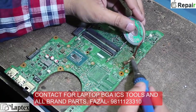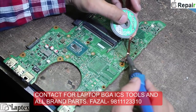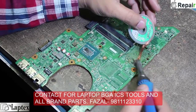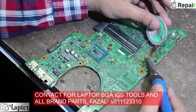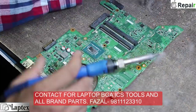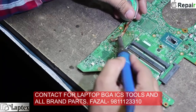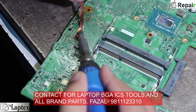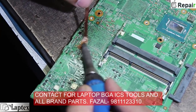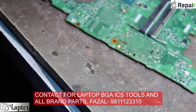Very carefully and gently you have to clean the tracks. While moving your soldering iron, only put the iron on the BGA track itself — sometimes it goes off and removes a resistor as well. We use good quality desoldering wick, and you can get desoldering wire from us. As I mentioned in my earlier video, we deal in all types of tools, BGA ICs, and SMD ICs as well.